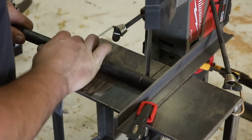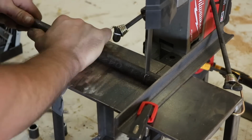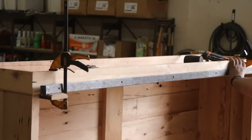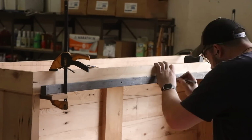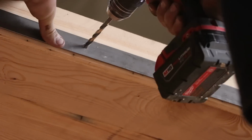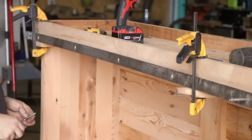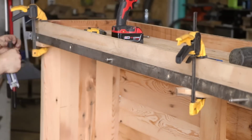It makes it quite easy, and then I cut some 3/4 inch pipe for spacers on the cabinet itself. What you do is you'll run the face screw onto the cabinet here, into the spacer, and then into the cabinet. What that does is sets the track off of the cabinet and lets it flow back and forth with some space behind it. You can see that right here.